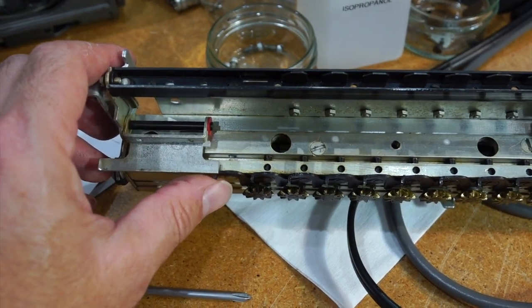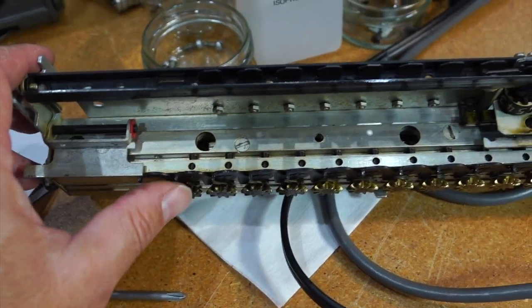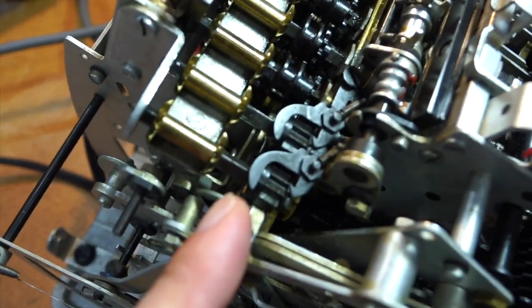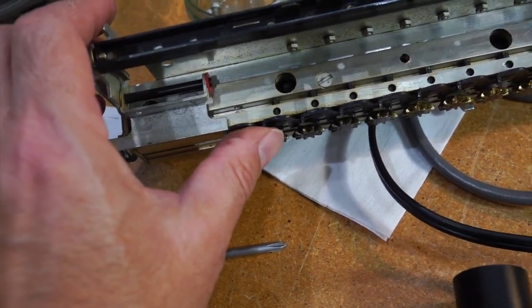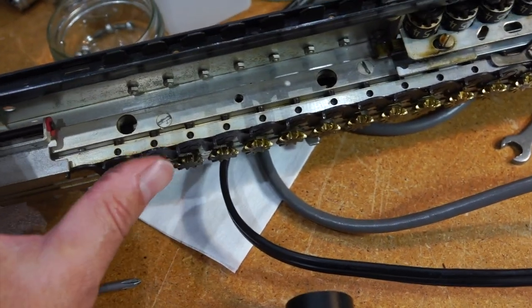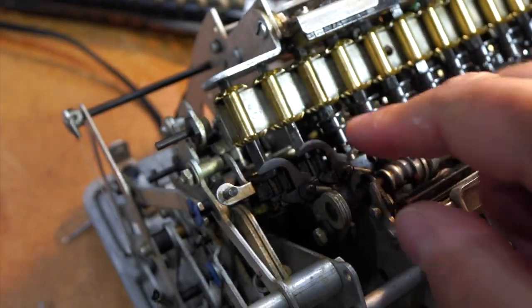Sorry for the long-winded explanation. I found about my problem in a roundabout way, while doing a bell test. The bell is supposed to warn you, at the end of the carry chain, to alert you that you had an overflow at the 14th digit and that your calculation is likely invalid. Pretty important bell. But I was never hearing the bell — at all. And that's just not working.